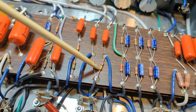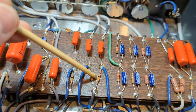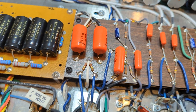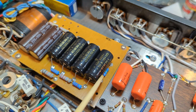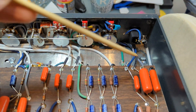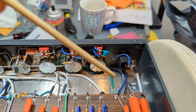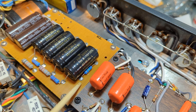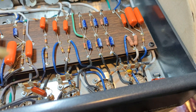These resistors are Koa Speer half-watt, and if you look at my JMSIG build, that's basically what I found they use — and I started using and recommending them for other folks building amps. Here's a fat drag resistor — I believe that's a 150k — that loads down and mimics a fat input. Some amps have a field-effect transistor circuit for that with an extra input or a relay switch, but this is very simplified. You don't see any of that.